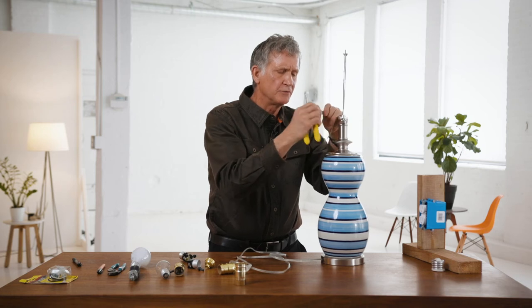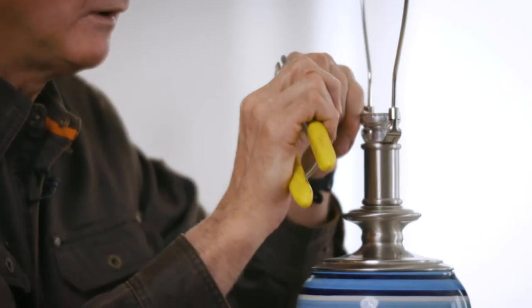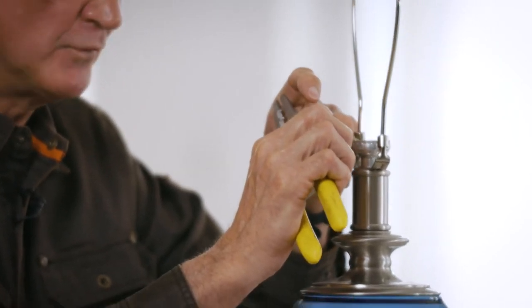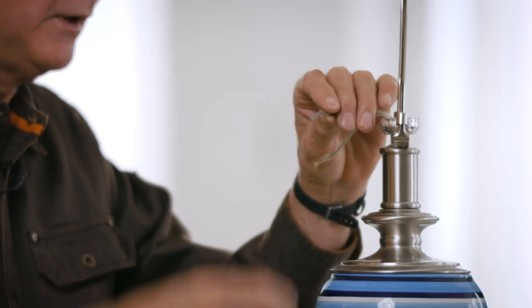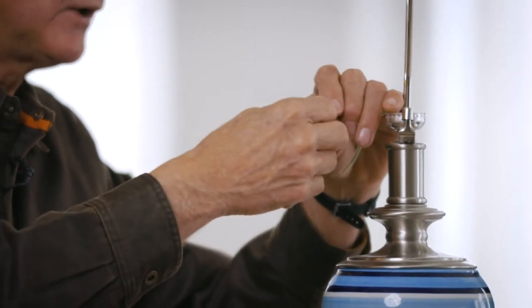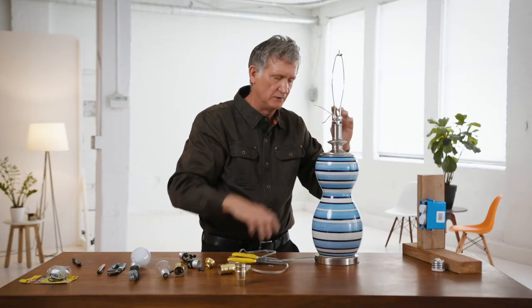You can take scissors or a utility knife — just want to cut the insulation off to get at the actual wire itself. And you want to twist: take it off and twist the wire counterclockwise, so when you screw it on, the wire is not going to flare out on you.